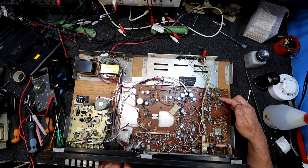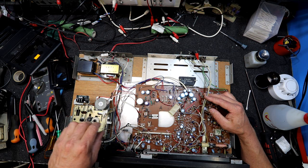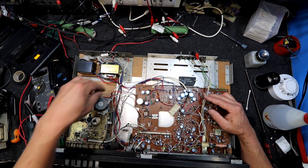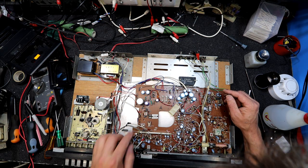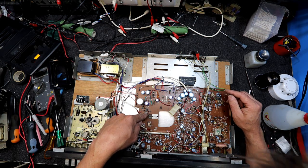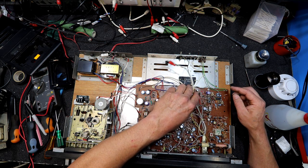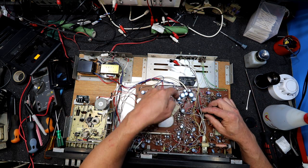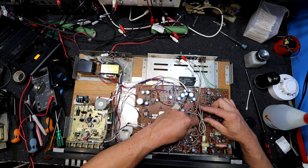That's probably something to do with the tape player. I can see what looks like bias oscillators, possibly. Where's the audio? That's the heads. That goes to the record playback switch, and that's more likely over here. That's probably the erase oscillator. What on earth's all this stuff then? Maybe that's a phono input or something. Phono comes to there and there. Or is that the phono code?